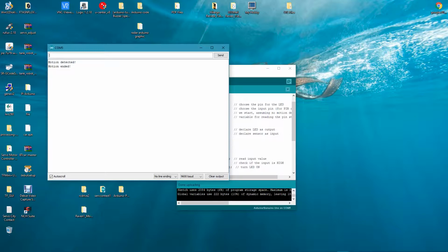As long as there is motion in the room, that pin's state will not change back. That's why I have it set in retrigger mode, because I don't want it going on and off, on and off, on and off. Now there is an application where I will be using that function. There I would do my solder jumper to the L side, and that would be for my photo burst. Every single time there is something triggered, I want a photo burst, and that would be on one of my critter cams. We'll go over setting that up at a later date.